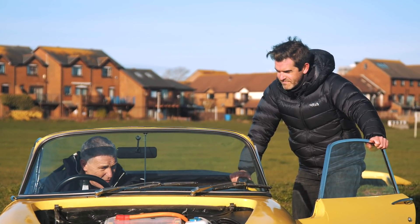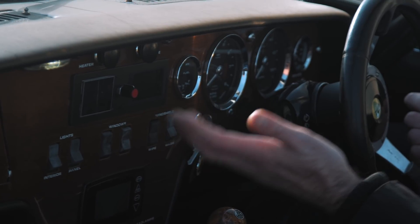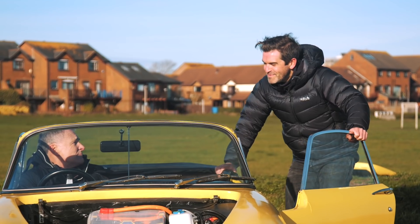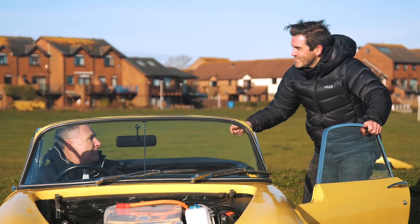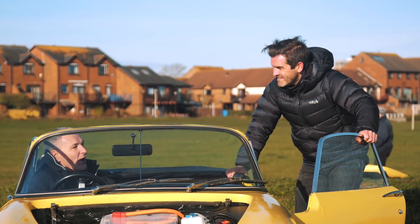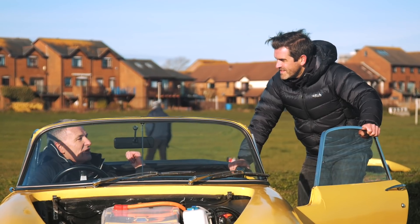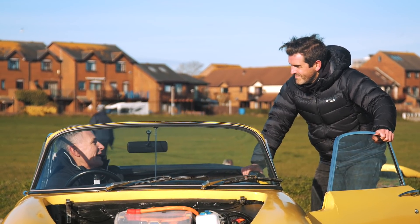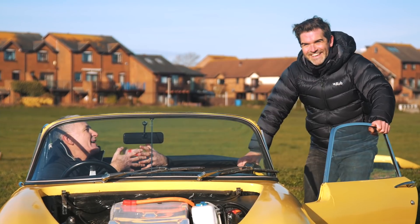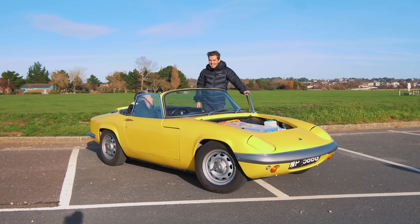Here we've got the important details about the battery, mainly its temperature as well as its range, and things like the voltage and the current it's taking. The power from these batteries is good enough to run all the electrics at home — 28 kilowatt hours is actually over twice the power of a Tesla Powerwall. I've got an adapter and a grid-tie inverter, so I can plug the battery pack into the house and it matches the grid at 50 hertz and powers all the base load of the house if I want to.